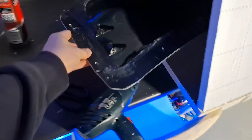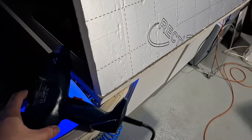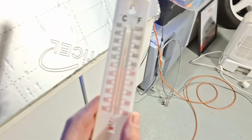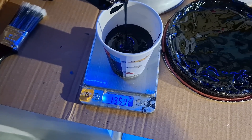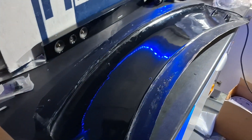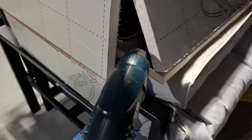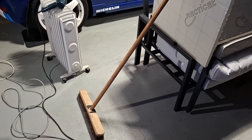So I'm going to do a trial fit of the lower part of the spoiler. It fits in very nicely in the available space — got plenty of room — and I think I'm just going to stack the other one on top of it, maybe separate it with a bit of foam. I'm seeing a good 20–25 degrees on the parts and I'm confident I'm going to get a good heat. So now mixing up some gel coat ready to apply to that lovely release-agented mould — just like brushing on gloss paint. You want a nice thick layer, aiming for a few fractions of a millimetre all over. I'm just warming that one up while I get started on the second mould which I'll stack on top. I'm using the upper part of that Toblerone tube as a means to introduce the heat and I'm using a trusty old broom to hold the door shut.